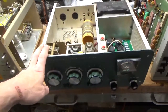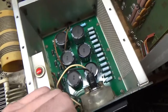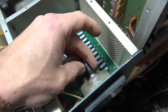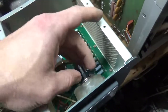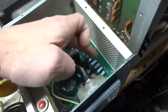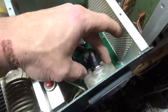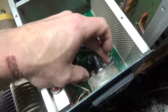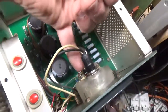Okay, I'm back with the completed Heathkit SB200. I'll go over everything I did. I already had the Harbach filter cap board kit installed. I changed the meter lamp bulb with the proper bulb. I spread the clips on the assembly and put a thin layer of silicone on the assembly to help stop it from popping out — I've seen it pop out before and touch a high voltage point. I took the outer nuts off the meter connections, snugged up the inner brass 3/8-inch nut, then added reverse-connected diodes across the meter movement and put the outer nuts back on.